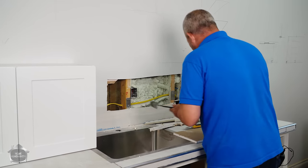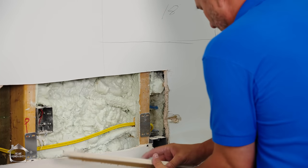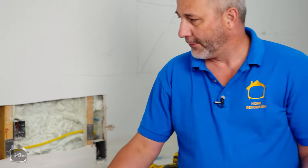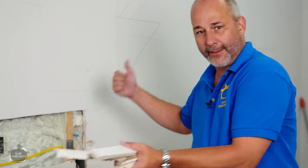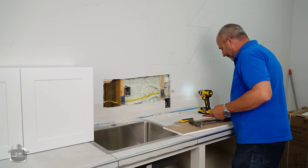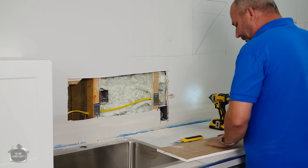They've been using nails on drywall since the 30s — there were little tiny panels. Somewhere along the way they came up with the screw idea, which was a better idea. Installers for years would use nails just to hang the sheet and then finish with screws because it's faster. Now that everybody's got an electric screw gun, nails are almost obsolete because we use magnetic bits.